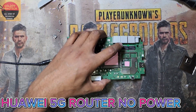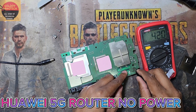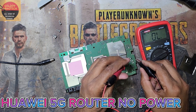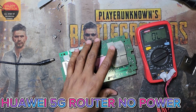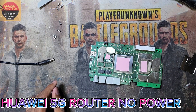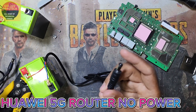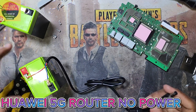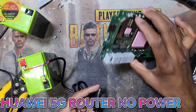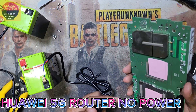I check this position. I have a full short — full short. So now what do I do? I need a battery — 6 volt or 12 volt. I have a 6 volt battery and I have a charging jack like this adapter. I connect the plus and minus of the 6 volt battery, and now I will plug it into the router. If there is a short, this little part will be broken, and this is the broken component.